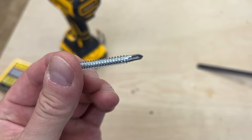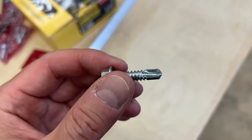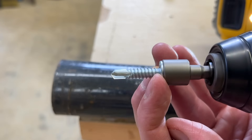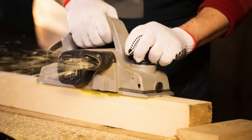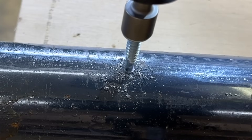You can identify self-drilling screws by this chunky, shovel-shaped head — they all have it. If you look closely, you'll see that the head also has beveled gullets on both faces. When rotating, these gullets create a paring effect, very gradually slicing away at layers of metal as they bore their way into a surface. It's sort of like what an electric planer does to wood, except that these screws do it from a plunging vertical position.